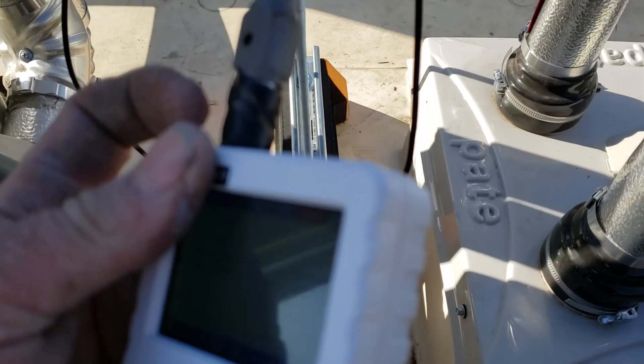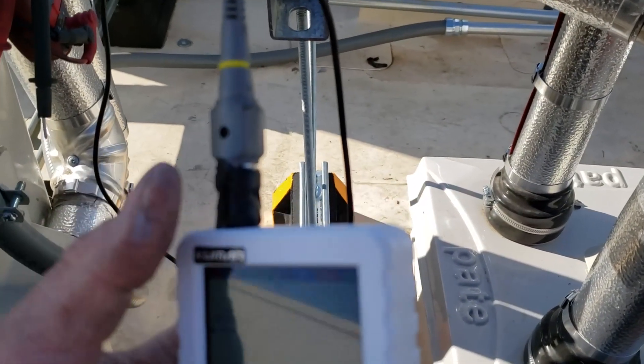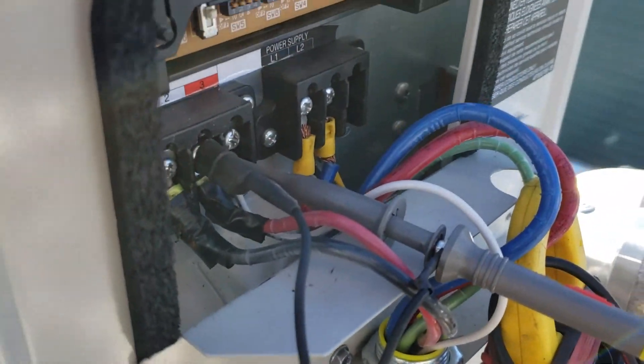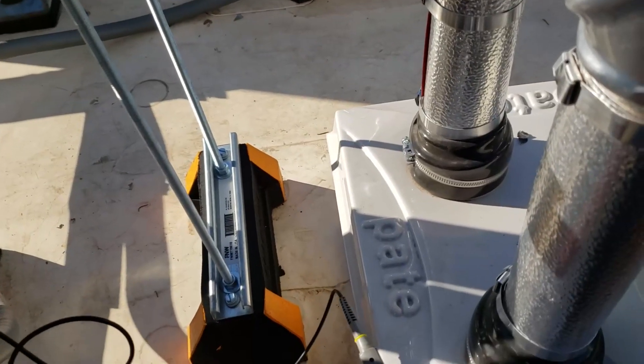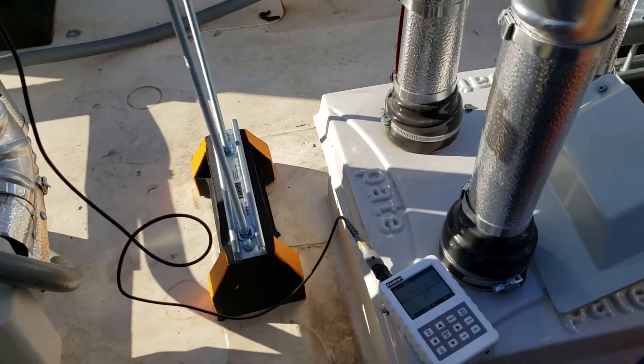I do need to be careful touching right here, so I have the electrical tape. There's high voltage potential to ground from that negative terminal there — S2. Got about 120 volts to ground there. I learned my lesson once: didn't have tape, set it down, let it touch metal — boom.